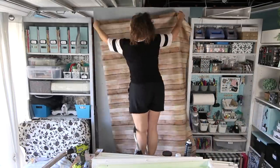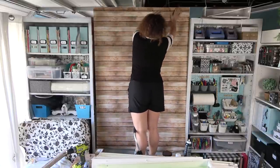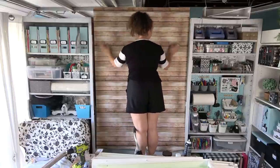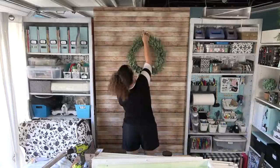Once everything was off it was time to attach the paper. It was already four feet wide — the exact same width as my panel — and not as long, so all I had to do was cut it down to size. I applied the spray mount to the wall and to the paper and it was a super easy attachment. I did realize later that because this is particle board and I didn't have a good sealant paint on it, the paper is pulling away, which makes me very sad. This hasn't happened on any interior wall or bookcases, but I have some options: small tacks, or slitting the paper and spraying more adhesive inside and using invisible tape to seal it up.